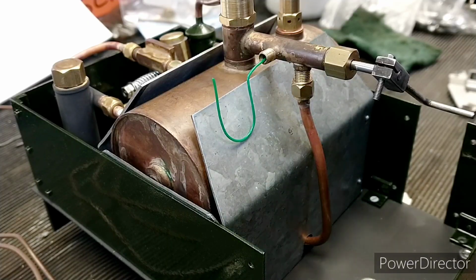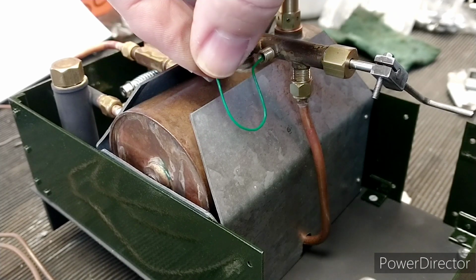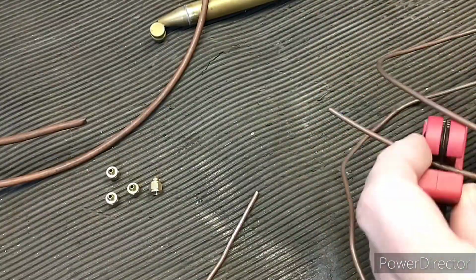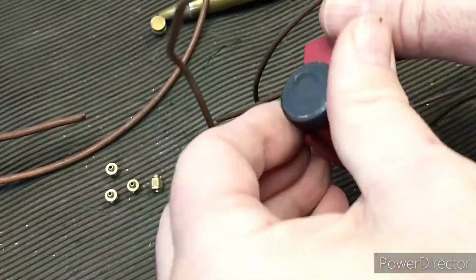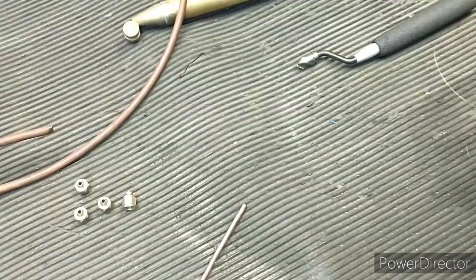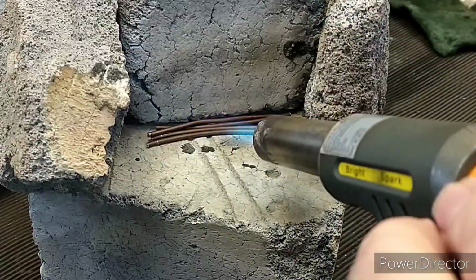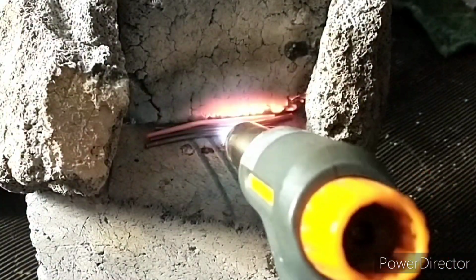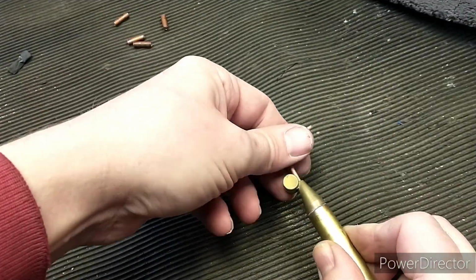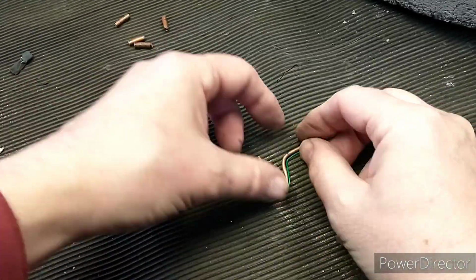adapter. So I've just got a bit of soft wire just to rough out, basically get a rough idea of how it's going to look. So I'm cutting the syphon tube to size with the pipe cutter. This was just a little bit too small actually, so it just really scored it, but I could then snap the pipe. And then this is the adapter, and now I'm annealing the pipe so it's easier to bend. And now using the pipe bender, so it's quite easy to bend because it's all nicely annealed and quite soft, and there we go.